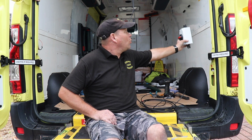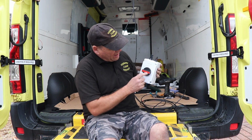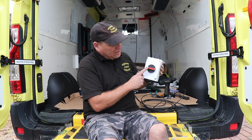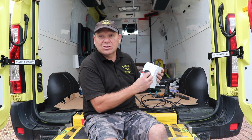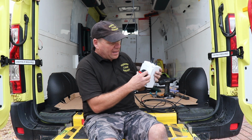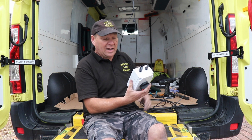I'll bolt that to the wall, and then we'll just connect it all up, and we can make sure then with the isolator switch, keep it off. This one's actually lockable, comes with a little padlock to lock it with, just to make sure nobody else can turn it on when you don't want it on. So we'll fix this all up, and that'll be the job done for now.